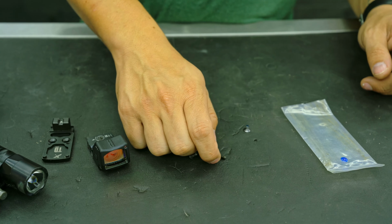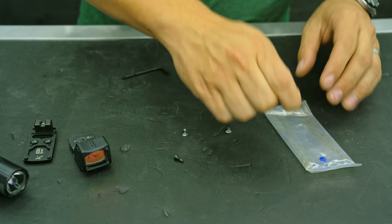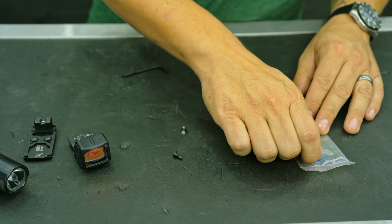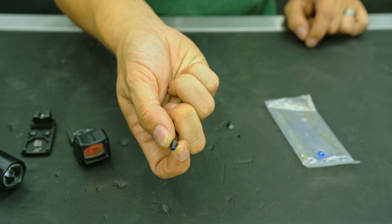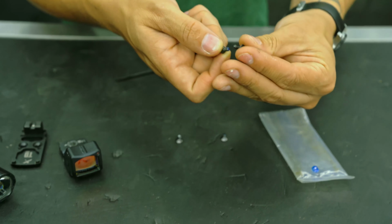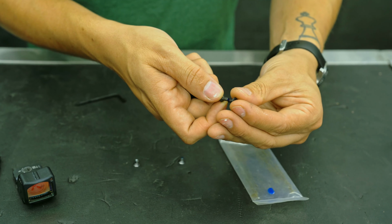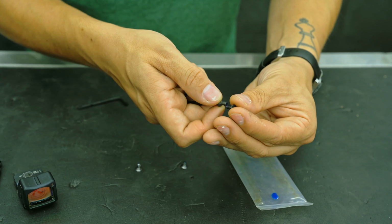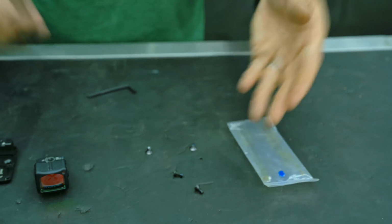As you can see, this one's already had a little bit of Loctite on it in the past, but that's okay. So just putting some in it. And again, how that is right now, you don't want to let it cure like that. That's way too much. It's just kind of a glob. So you can take the matching screw and run it into each other, so that way there's only Loctite in the threads. Now I try to let those sit.